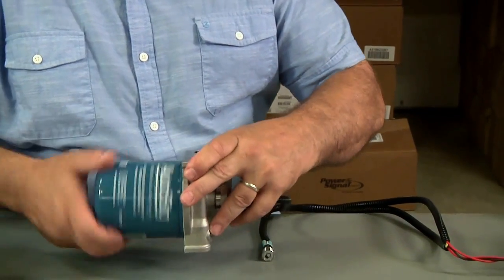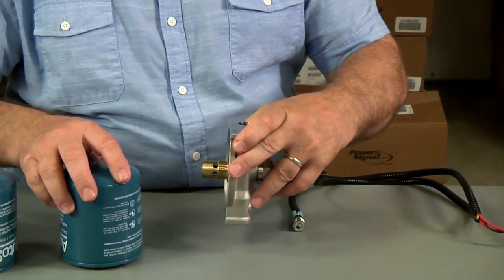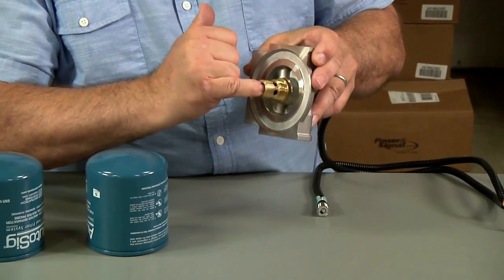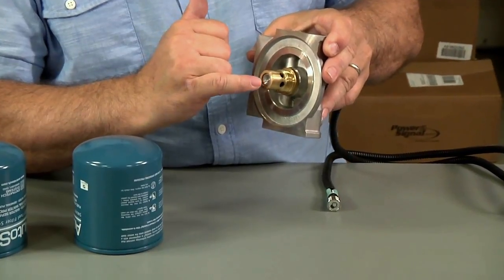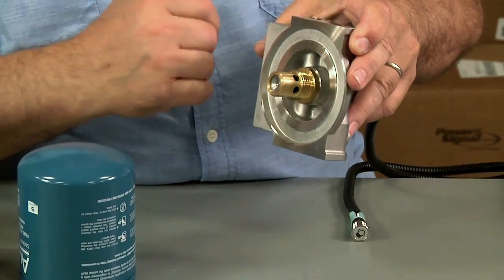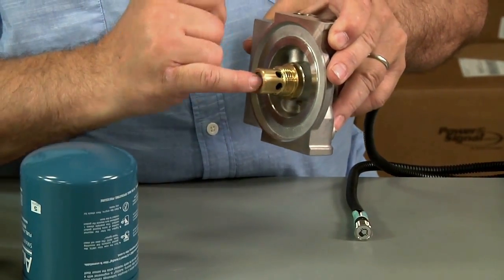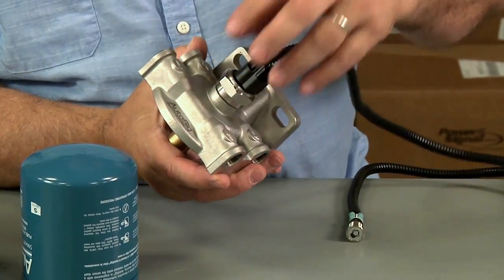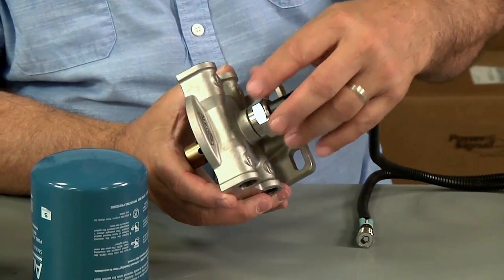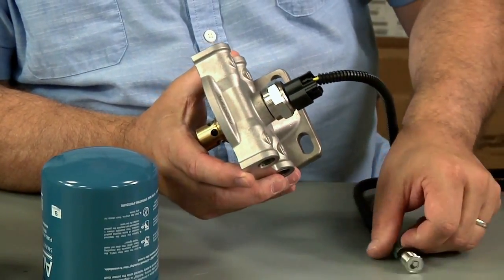That's a little bit of the magic of Autosig — the head of the filter has what's called a touch plug, which makes an electrical connection and is spring-loaded to compensate for variations in manufacturing the filters. That sends a signal into the filter head where there's an electronic package — your whole water sensor — everything needed to turn on an indicator light.